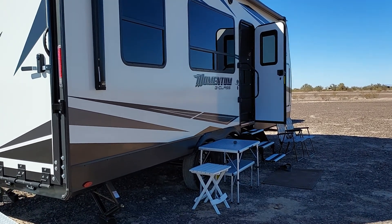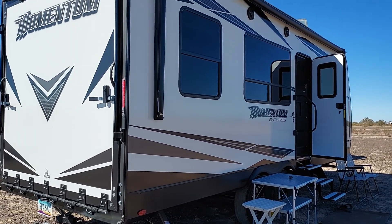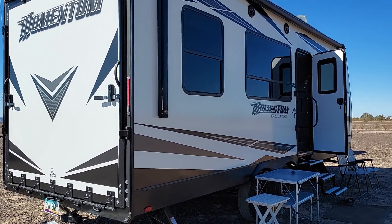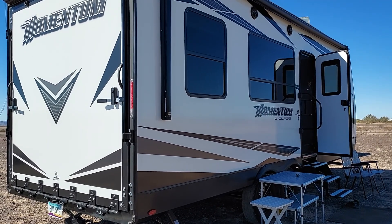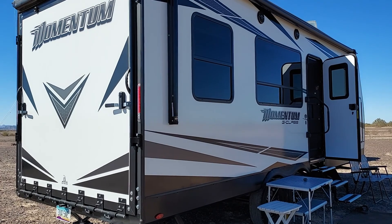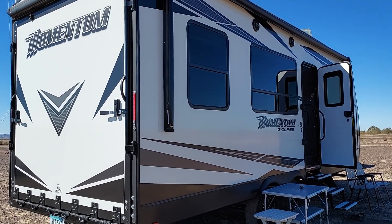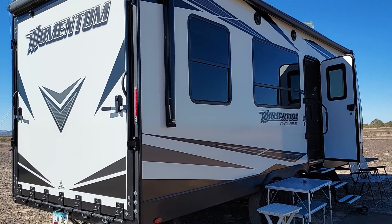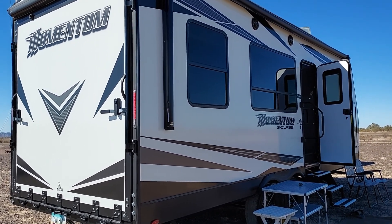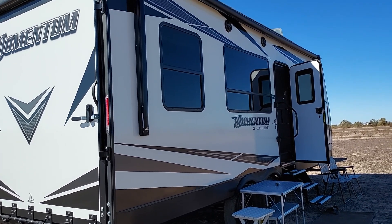So if you're going to upgrade your batteries and do a lot of boondocking, you're going to need more than what I have. 150 amp-hours isn't enough — you'll need at least 200 if you want to do anything beyond just running the refrigerator. The 12-volt fridge has a night mode which I turned on around 10 o'clock last night — it runs for eight hours on night mode, then goes back to the regular setting. I have it set to level 3 on both the freezer and refrigerator compartments.